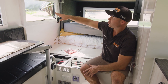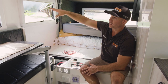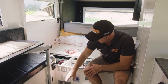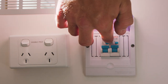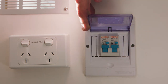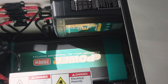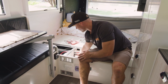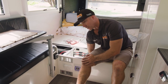As before, we talked about plugging into the van — checking our lead first, making sure it has power and our power source has power. Once plugged in, we've got our RCDs down here. These are the first ones we want to check if we're not getting any power, as your inlet runs into this RCD here. We want these up, just like at your home. Making sure that is up.